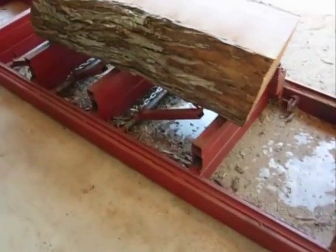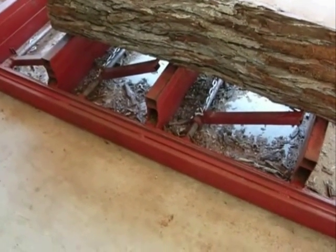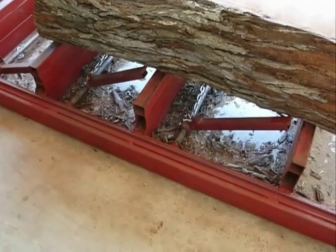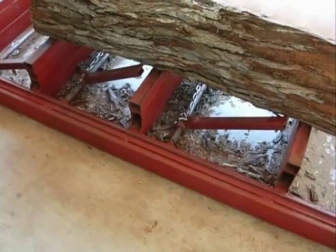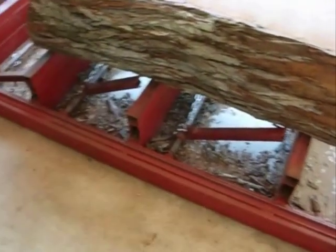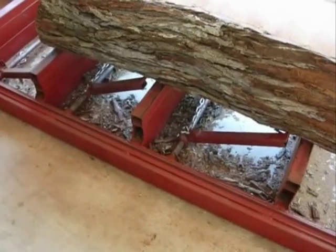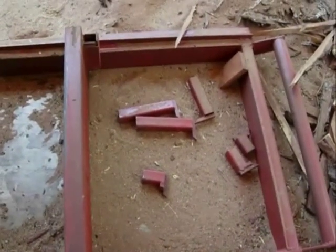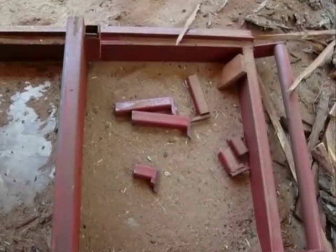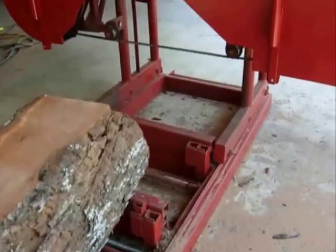Because it's so rugged, the first important part is having a good sawdog system, and I like this system. It's a three-quarter inch galvanized pipe with a one-inch galvanized T welded to an inch-and-a-half 11-gauge square tubing, with a half-inch bar stock at the top that's been sharpened and digs in. I tap it in with a sledgehammer and then hold it in place with a spring and chain setup. On the other side I have different length dogs to hold the log in place and keep it properly positioned close to the blade.